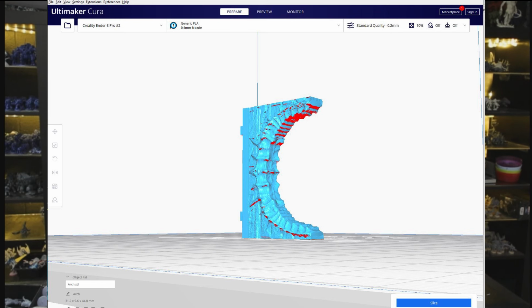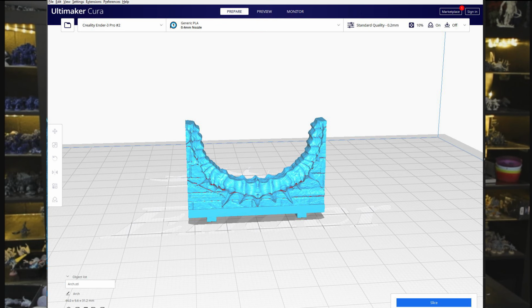If you're using a slicer, the process is going to be very similar. You're going to put your 3D file on there, put it on the print plate however it looks, and then determine if you need some type of supports for the model itself. FDM printing doesn't necessarily like very sharp angles. So things at a 90-degree angle that are hanging off the plate are not going to print very well. One of the things you can do to solve that is put supports onto the print itself and prevent that from happening. Supports are extra material that you're not going to keep after you're done printing. So you want to consider your model on the print plate to minimize how much support you actually need on it.